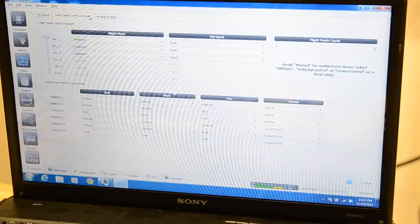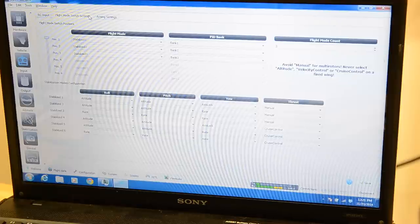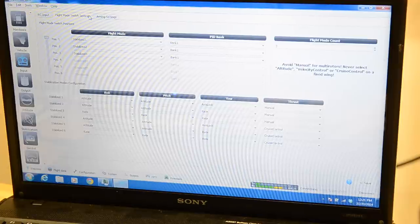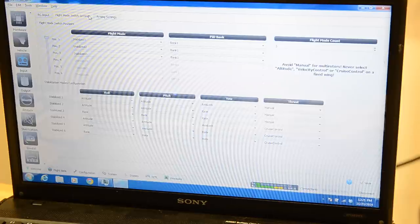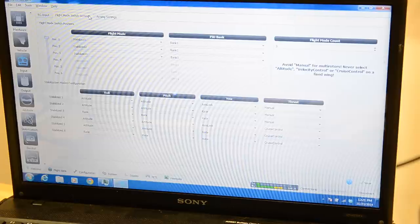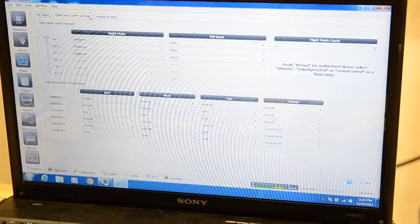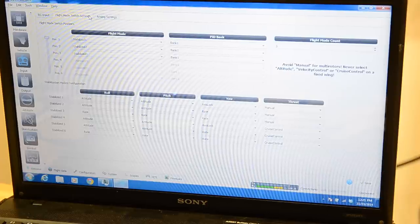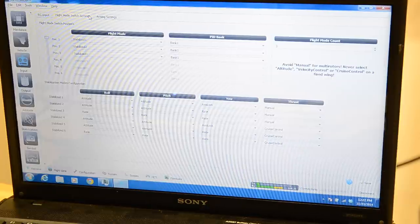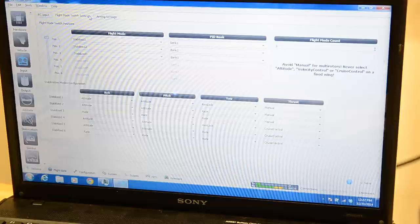So I'm just sitting here, just checking out my flight modes, and I'm going to come back into this and mess with this a lot later. That's going to be a totally separate video. I'm actually just setting up a default in which it will fly. But at any rate, I'll come back and mess with these later, maybe in an additional advanced type programming on this. But right now, we're just going to set it up. All these are stabilized flight modes. You can see there are already some defaults set up for attitude, axis lock. So those stabilized modes there will correspond to what we're doing, and the PID banks is all set to being bank one, and we'll come back into that much later and look at another video, because that's a little bit more complicated. Right now we want to build the quad and do a test flight for this particular video.